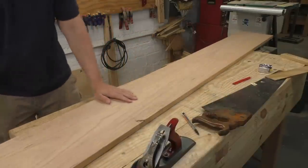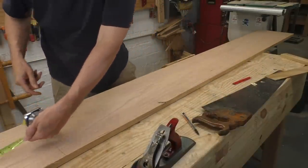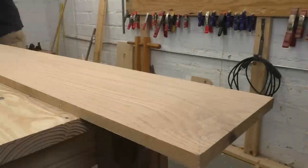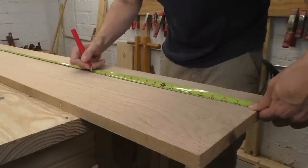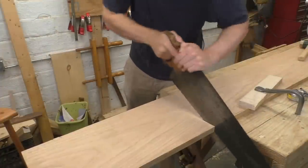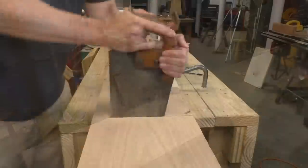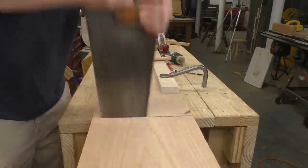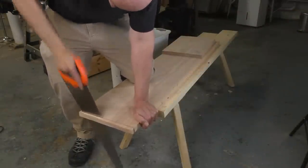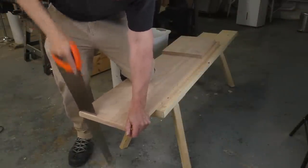Mission furniture was typically built from scrub oak and ponderosa pine, and you cannot get either of those in Ohio, so I'm building this out of red oak. Southern yellow pine would be another good choice. You need about eight feet of lumber to build the whole thing — it's an economical project. The easy first step is breaking the stock down. I tried some different cross-cutting methods, but nothing works nearly as well as my new lightweight traveler workbench, which I did a whole video on last week.